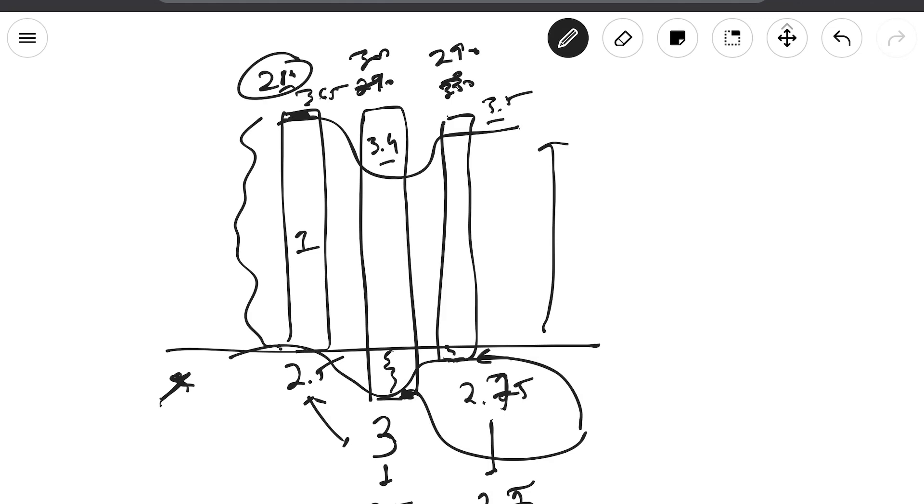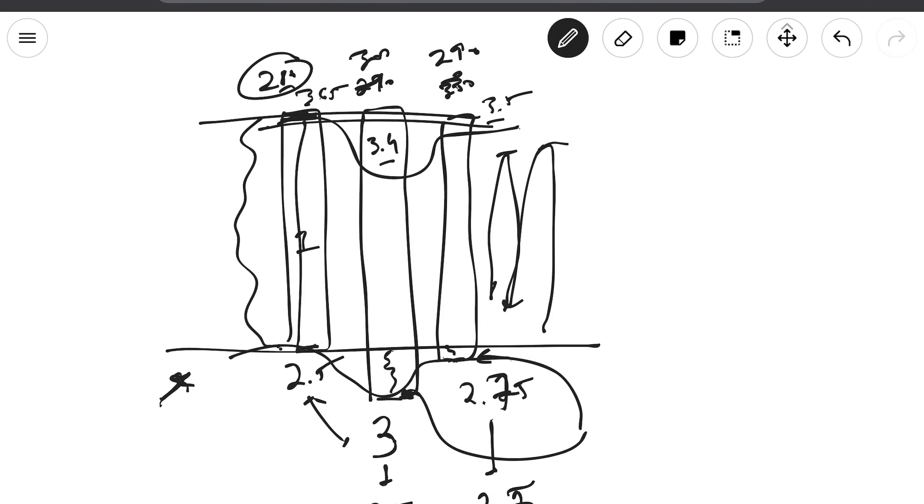And guess what? It didn't change a thing. We burned off that extra power when we were at the bottom — totally flat and balanced — but when we recharged, our voltage changed again because the first cell doesn't have as much capacity. So it filled up and hit 3.65, but the other cells are at like 3.4 and 3.5. We lost our top balance. We bottom balanced when we sat at the bottom. So there wasn't actually any gain in performance. This passive balancer didn't do a thing for us.